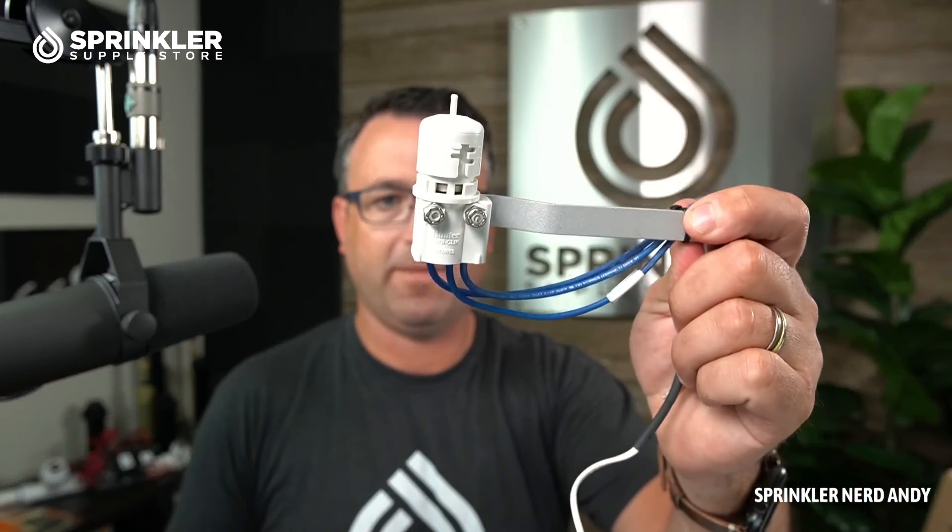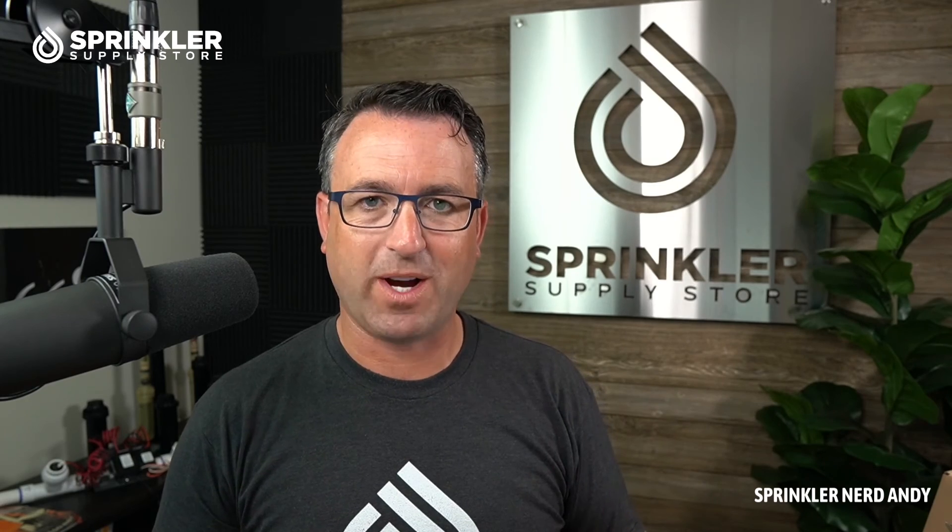These Mini Click rain sensors have been around for a long time — they're proven and reliable. The only disadvantage is you have to wire it, so if your controller is in your basement or inside and you don't want to drill another hole or run a wire outside, it could be more advantageous to get a wireless rain sensor, and then you can put the sensor basically wherever you want. I hope that helps answer some questions about what a normally open rain sensor is and the difference between normally open and normally closed.